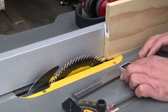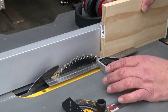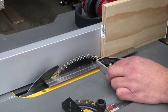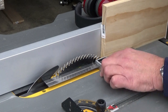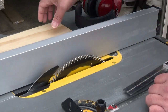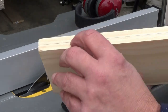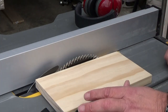To do that, we're going to raise our blade up and put a straight edge across the blade. I've got a block here to represent the thickness of our material and I'm just going to bring the fence over towards our straight edge until it touches. That gives us our thickness. Then I took a scrap piece and drew a line dividing it right in half, set it over here, lower the blade right down to the center of that, and that'll give us our thickness.